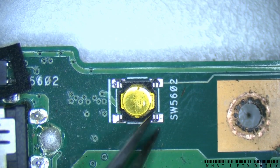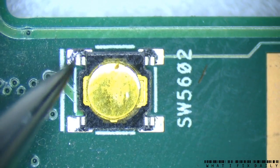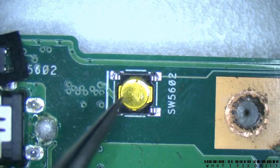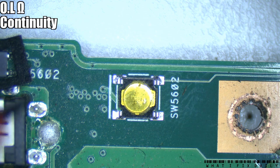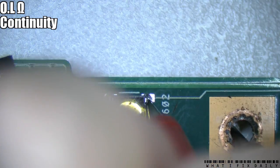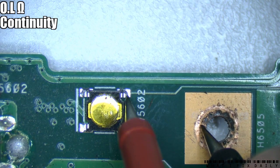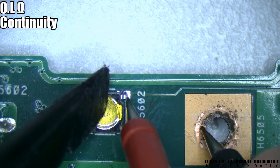Let's have a look at this under the microscope and see our switch assembly. The soldering is not great — it's a little bit head-in-pillow style, like there's no flow over the tops, but that's okay. I'm going to check the continuity of the switch when pressed. So we should see this line here get pulled to ground when we press the switch. And that's all good and fine.